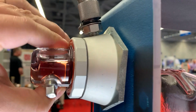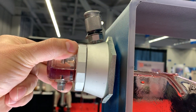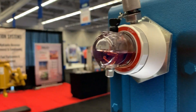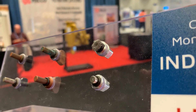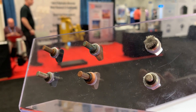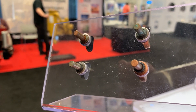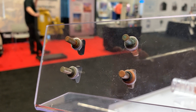The sight glass is rotatable so you can pull the indicators out of the fluid for further analysis. The indicators include a magnet for catching wear debris, copper to indicate changes in the pH level of your gear oil, and a steel indicator that will rust in the presence of water and when your rust inhibitors have failed.